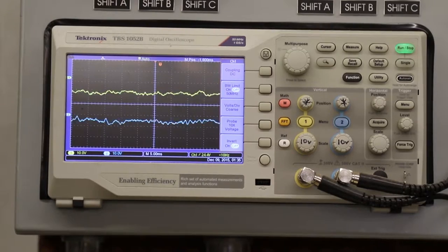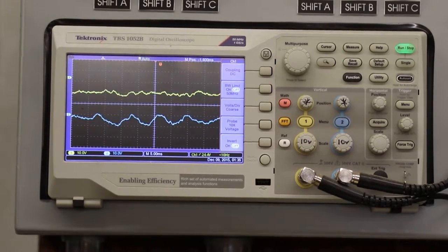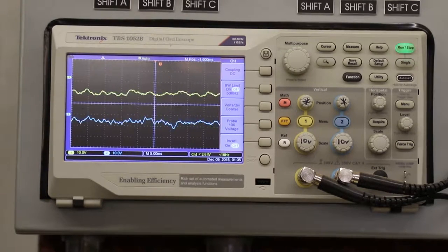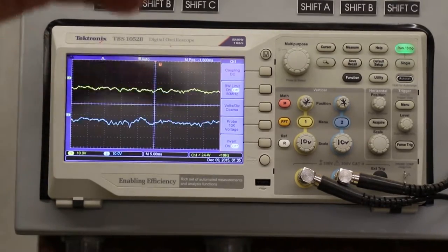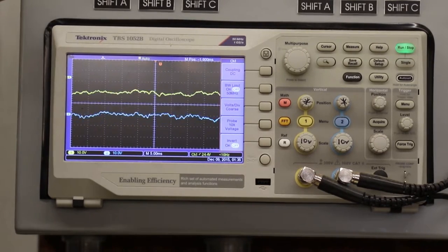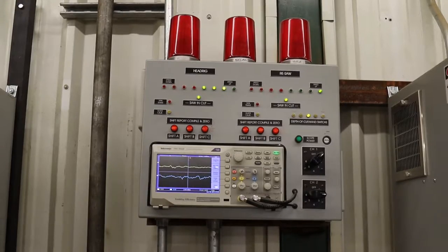This has been very useful in many mills. Some of the modern band mills are using cheaper bearings with greater tolerances, and it tells you that those bearings are not tight enough — they're not high-grade enough. So that's the basic unit that goes in the file room. The lights on top will alert the filers to problems that they can check out and see what's going on.